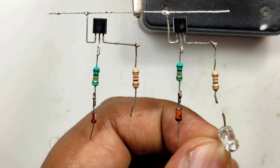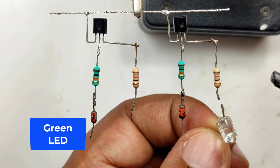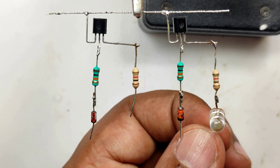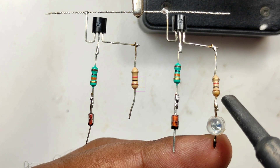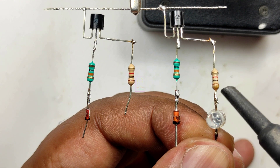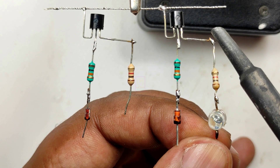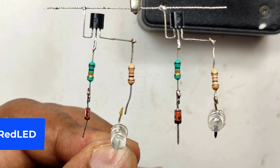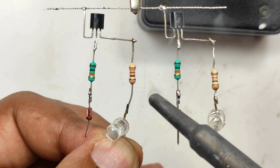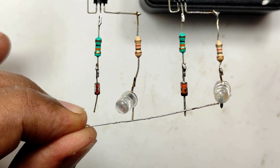You might have heard that while using a soldering iron on SMD chips and some digital ICs, we need to be more careful about static electricity, else that will make the chip faulty. When I touch the LED terminal with the iron, the LED is lighting. I am not wearing any footwear and my feet are touching the ground — because of the static current flow the LED is lighting. So when soldering those kinds of components, either pull the plug of the iron from the socket or isolate all terminals from grounding. In short, block the loop of current flow.